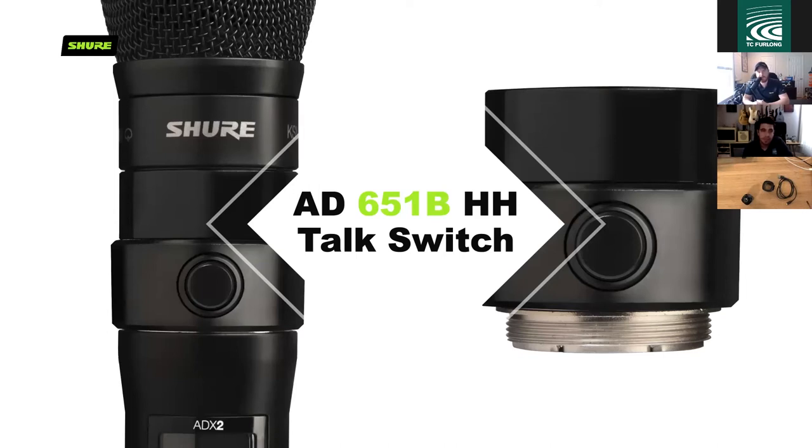Essentially what happens here is that your talent can press the button on that stick mic, and that is going to reroute your audio from your Axient Digital receiver to a couple of places that you have a choice. So on Axient Digital, you've got four outputs. You've got XLR and tip ring sleeve output. Then you've got Dante and you've got AES. So there's a little four port matrix inside of Workbench and inside of the Axient Digital receivers themselves that allow you to route your talk switch audio. So essentially, if I had my main output coming out of my XLR and my talk switch output coming out of my TRS, when I press this button, the audio from that stick mic is going to come out the tip ring sleeve output instead of the XLR output.